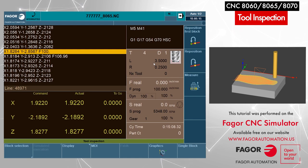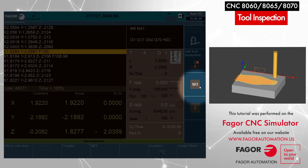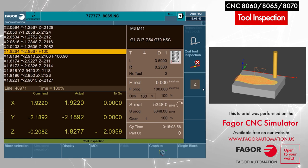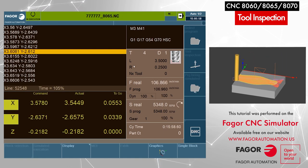You have to remember that if tool radius compensation is active, the new radius will be considered as well. Once that is done, I press reposition to reposition the tool back to the point where it was interrupted. Since we stopped the spindle, the M3 icon appears — I select it and press cycle start, and the spindle comes on. I then reposition on the Z-axis and press cycle start. It goes down to the point where the program was interrupted. Now pressing cycle start will continue machining with the new tool from this point on.